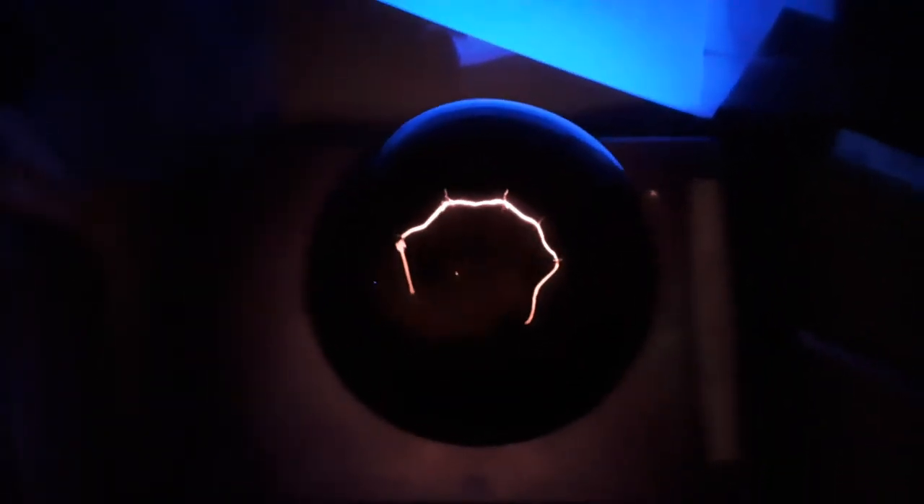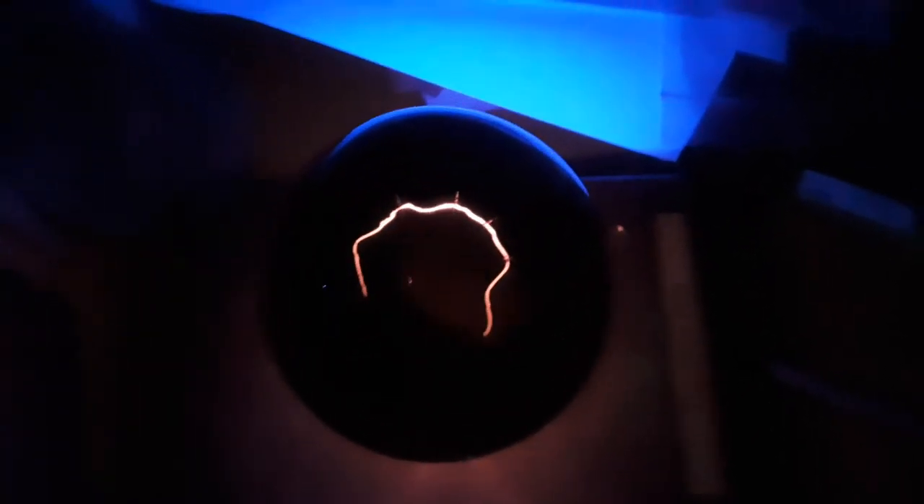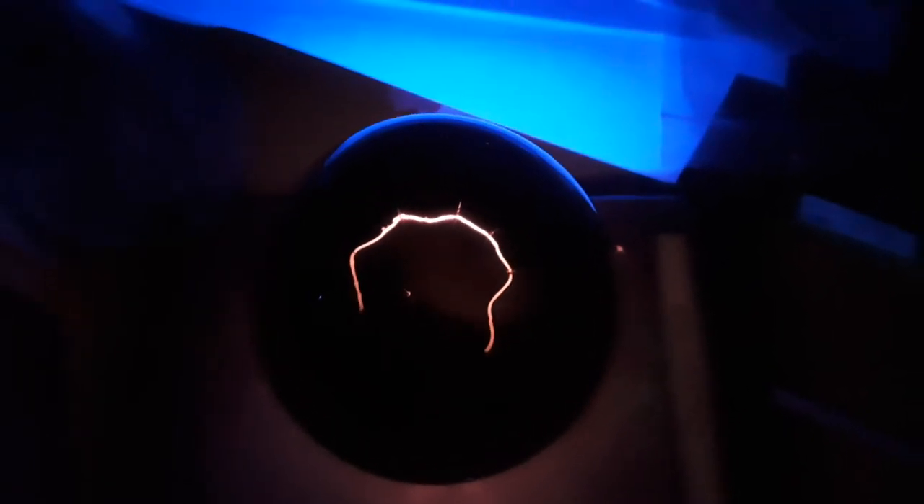As you can see now it's like a C-shape. The filament reminds me of a lightning bolt — it looks like the eclipse of the sun, like lightning during a thunderstorm. You can see all the support hooks holding the filament in place. That filament serves as the self-ballast, acting as the ballast, igniter, and capacitor all in one bulb — that's what ballasts the mercury arc tube.